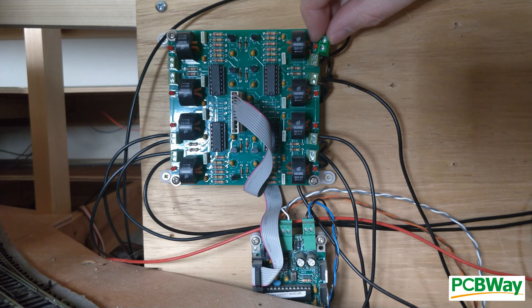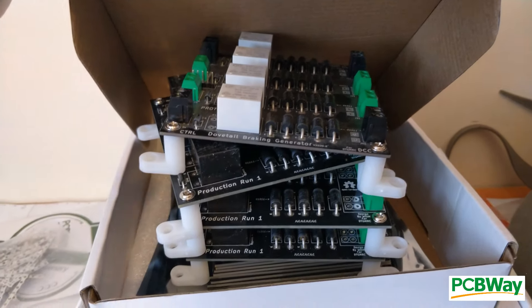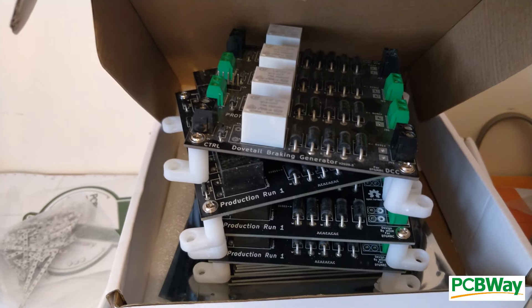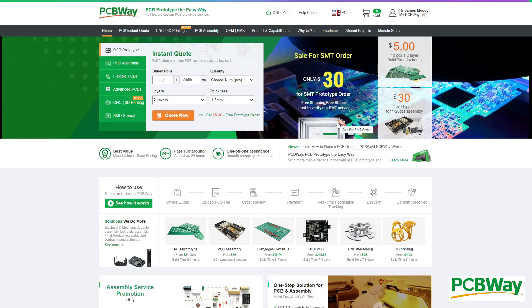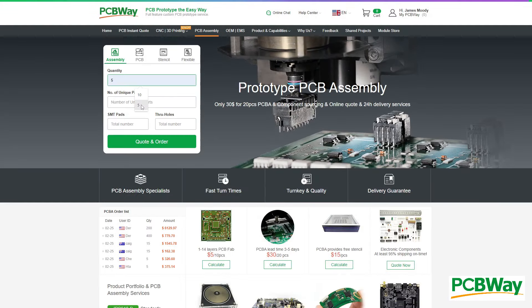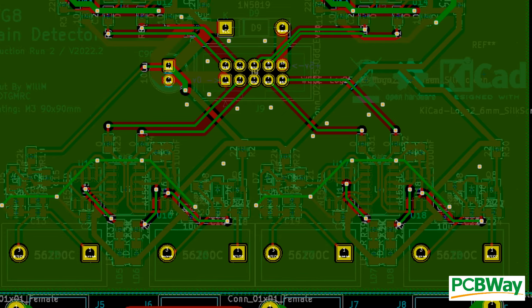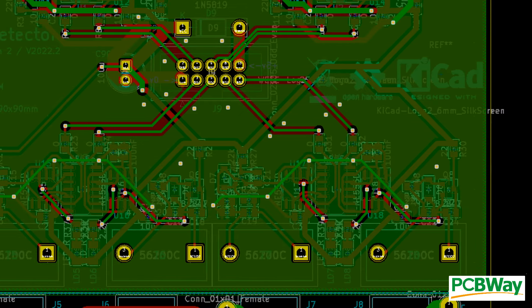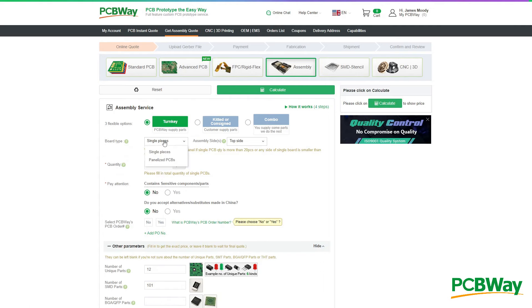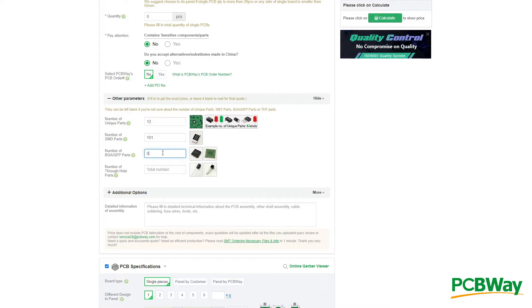Also, I've still got to assemble all of these once they arrive. That's a big time sink and also introduces the potential for mistakes. Unlike your first one, which gets installed and tested straight away, production boards could have mistakes go unnoticed for a while and become hard to trace. A handy solution to both of these problems is to use surface mount components. As well as taking less physical space, they also don't require a hole through the board to mount, which means that the tracks on the back of the PCB don't have to go around the mounting hole. Installing them yourself is a very difficult task. However, just like I can have a PCB created to my design rather than etching one myself, I can have the surface mount components installed to my design too.